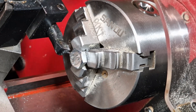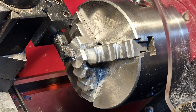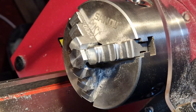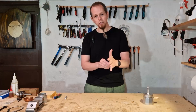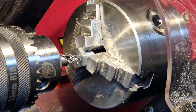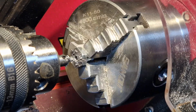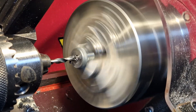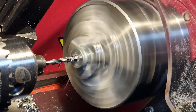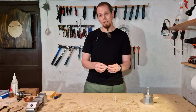The first step of making this pressure safety valve is to take this nut and clean up the surface to make a nice seal with a small o-ring, and then drill a hole through the nut itself. I will drill the hole 1.5 millimeters and then make the inner diameter of the stopper 1.2 millimeters, so there is space for the steam to press up against the o-ring and release when necessary.